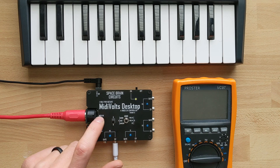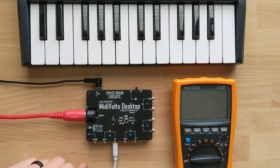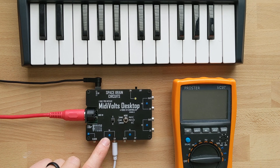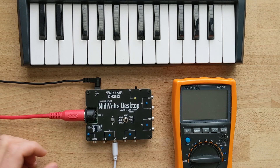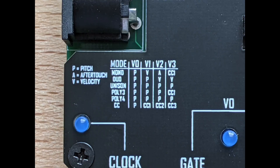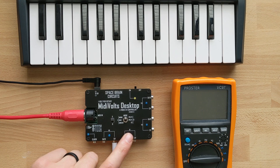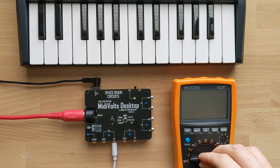Currently it's on mono mode because the switch is up to A and the toggle switch is up to the mono position. In monophonic mode, V0 is going to be your pitch CV, and then V1, V2, and V3 will be assigned to something different. You can tell what those assignments are by checking the tiny chart on the left side of the device. In this case, V0 is pitch CV, V1 is velocity, V2 is aftertouch, and V3 is CC1, which out of the box is assigned to the modulation wheel.